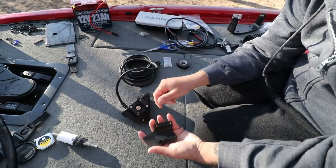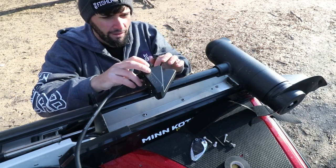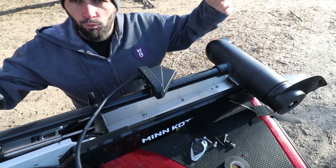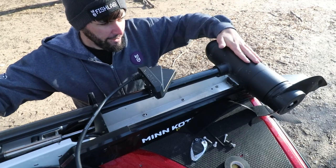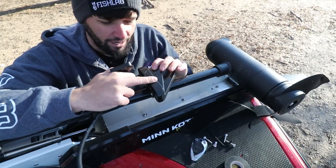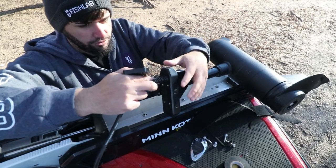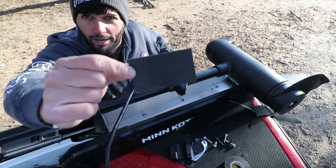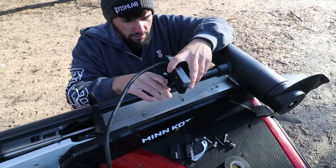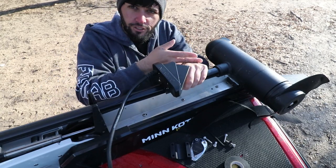We need the rubber mat, the other piece, and the last four bolts. I'm going to put the transducer about six inches from the head of the trolling motor. Also keep in mind which way your trolling motor sits when you put it on the base — I always put my blades on this side. If you put this transducer on the wrong side, whenever you stow the trolling motor it's gonna smash the transducer, so keep that in mind. The kit comes with this black rubber piece to keep the transducer in place so it can't slide up and down the shaft. Six inches is about the right amount.